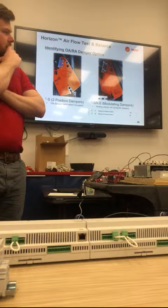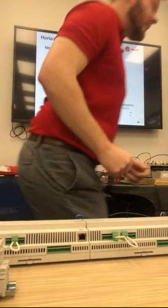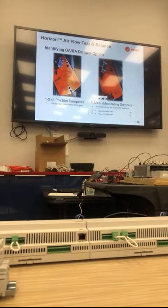So just to clarify a little bit, where it gets mounted, the actuator's right here, this is the pin that holds it in, and this is where it's being screwed into the sheet metal. The issue we're seeing is that they were extending it out, and the torque of the damper just twists this, and it can pop out. So I think we're moving to get the actuators mounted like this.